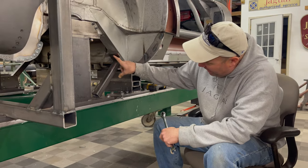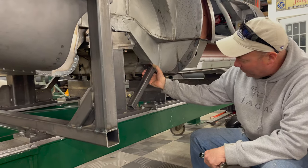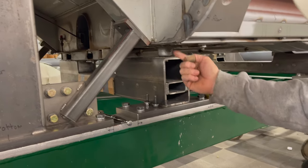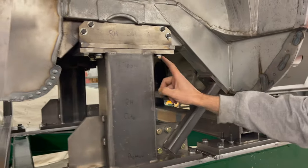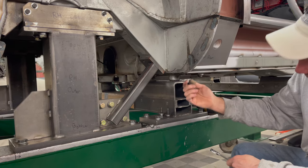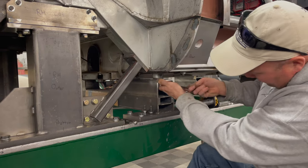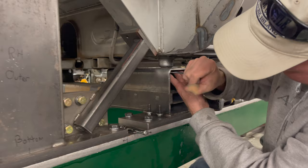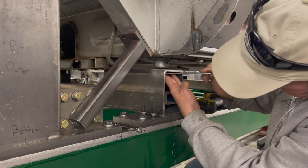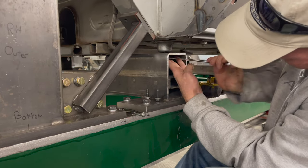It's a moment of truth. I've taken out these two bolts here and they came right out like butter, no problem. The shim is still wedged in there, which I suspected. What I've got now is the bolt going up through the radius arm cup and then these four bolts on the tower. With the radius arm cup, I was surprised that I was able to get a bolt into it — I really cranked it down and kind of stretched the floor some when I put it in there. So I'm not going to be shocked or upset if that pops back up. And see, it's coming up — like I said, I stretched the floor.